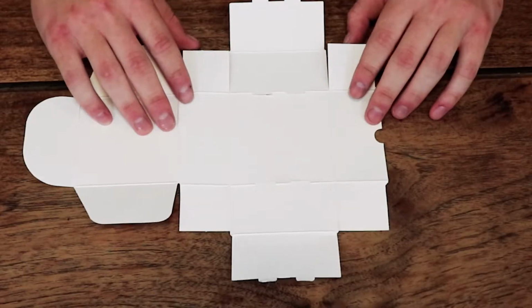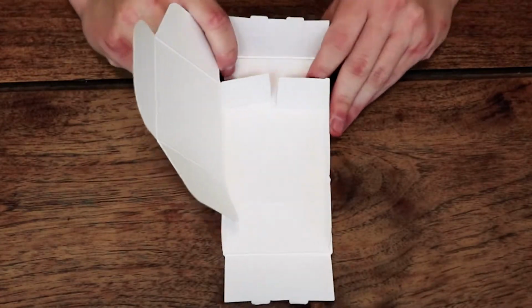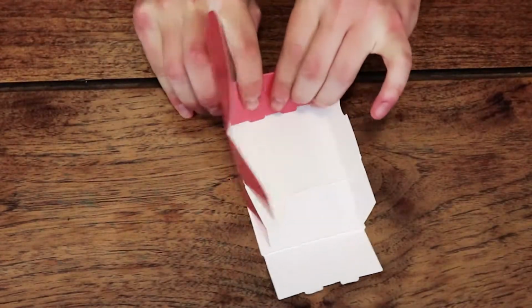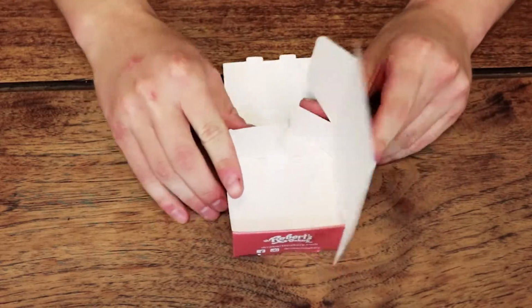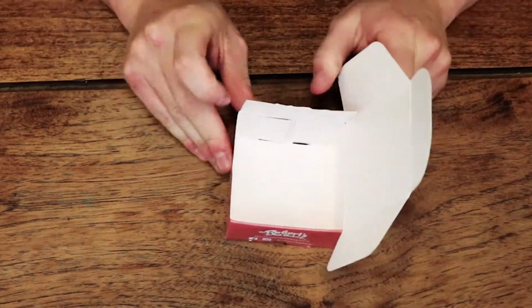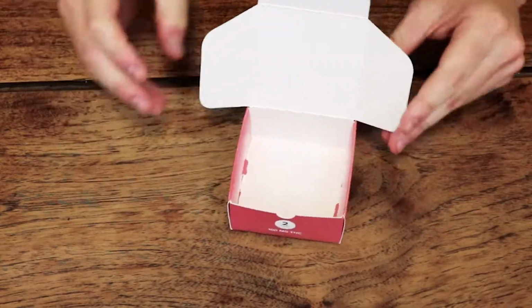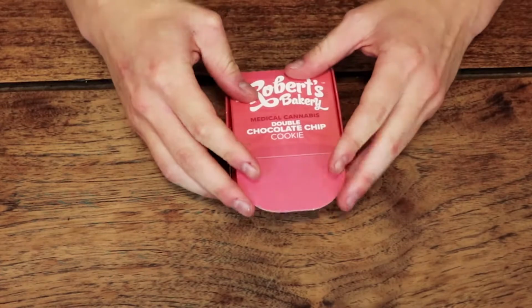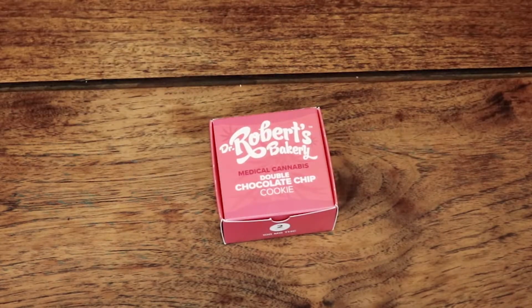This style is different in that there is essentially a lid instead of a tuck tab that opens and closes on a hinge. Typically there are flaps, called dust flaps, that come down from the lid into the sides of the box. Dust flaps keep out dust, but they also give the lid more strength. There are then tabs called cherry locks that lock into the front of the box. The benefit of this box is that there is a much better open box experience as you unveil the whole product when the lid gets lifted.